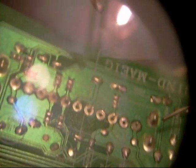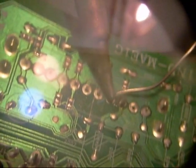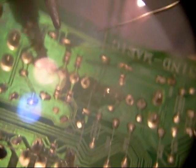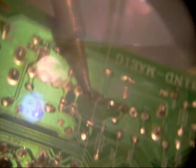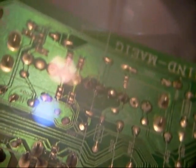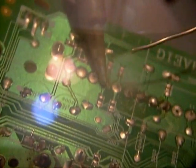As far as soldering technique goes, there are a few tricks to know. When you're adding your solder, you want to do it as quickly as possible but make sure it flows adequately — if you don't get adequate flow, you won't have a good connection. You also don't want to overheat your connection. If you hold the soldering iron on there too long, not only does it harm the connection, but you can damage a component — you don't know where the heat's going to travel, like if you're soldering in a transistor. Don't overextend the time your iron is on the terminal.